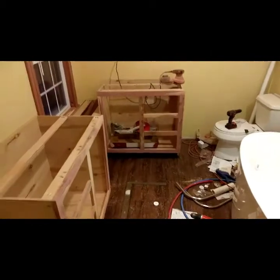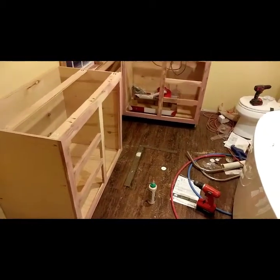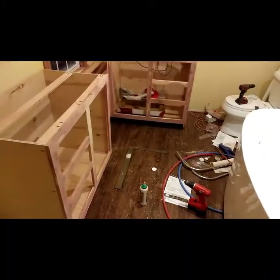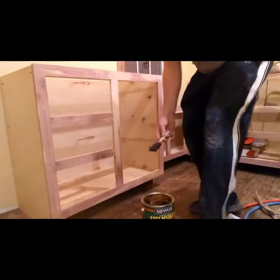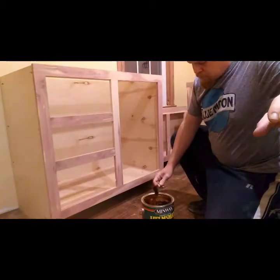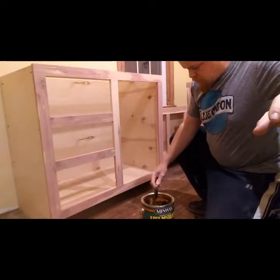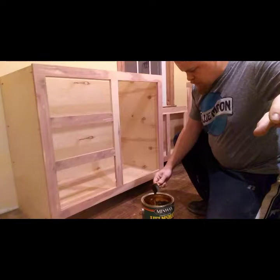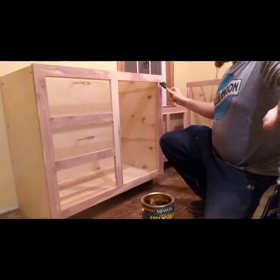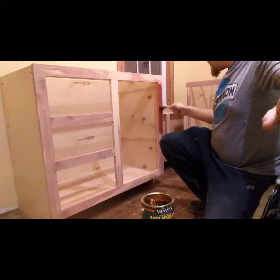But anyway, this is the way they look. I'm going to go ahead and put a finish on them, and I will record that process so you can see that at least. And I'm using spar urethane. Usually takes about 2 to 3 coats. Almost always 3 coats. But this stuff here really makes the grain pop.